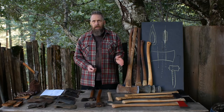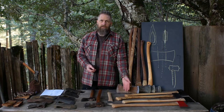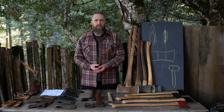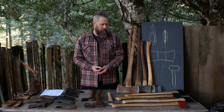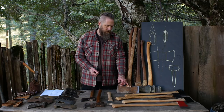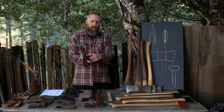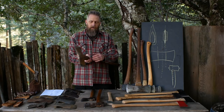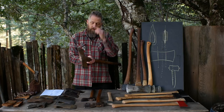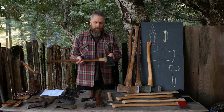Most used axes you'll end up doing a little whittling, jumping the head further on, getting out the wooden wedge, re-wedging, and doing what you have to do to get it tight again — it's often very doable. Don't overlook using a used handle; don't overlook being able to straighten it. What's not okay is if the handle was sitting on damp ground or soaking in water and the inside of the eye has become attacked by fungus and rotted — that's usually a deal killer. If there's cracking up by the eye from a side impact, you might be able to jump the head down, seal it, pinch it back together so the broken portion is up in the eye, and wrap it — that can work for quite a while.